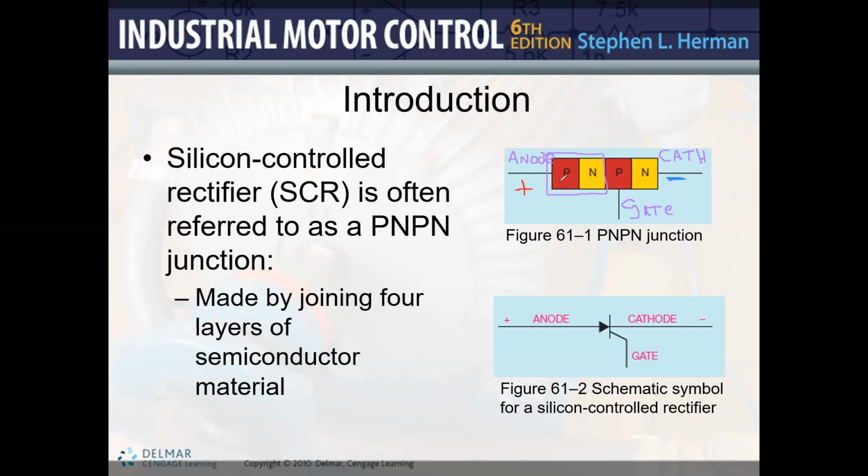Because we have two diodes connected like this, pretty much back to back, there's going to be a potential barrier developed right here on that side of the semiconductor material. The electrons are going to be pushed because we have an excess of electrons, in this direction. But because we have a positive material here, the electrons would try to travel through the positive, but they would be rejected by this negative N type.